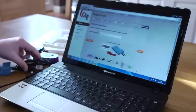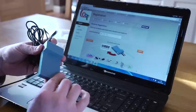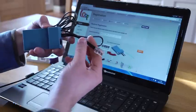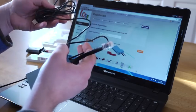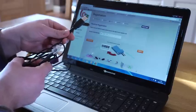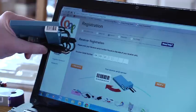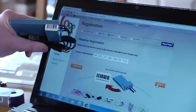The next stage of the process is to install the Loop receiver — that's the blue box. Three things to note: the receiver serial number is located on the side just below the sticker with the barcode. This cable has an ethernet jack that will connect into the back of your broadband router. And this cable is your power supply cable which has a USB jack at the end which will plug in to the power supply plug. The receiver serial number starts D4F027 and then you enter the unique digits thereafter — in this case, 80087EFD — and then click Next.